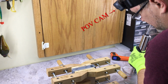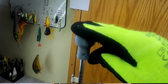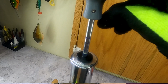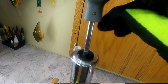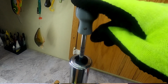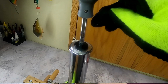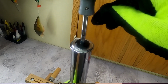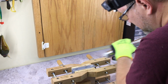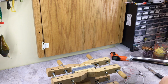So I'm going to suck up the plastic. Start injection. Just 2 fingers of pressure, nice and slow. Watching that line. And as soon as it stops, just hold pressure for a bit. This mold has some small gates in it, so I do have to inject slowly, but slowly usually works best anyway. Alright, just going to pop that out, top off my sprue, and clean out my injector. And wait another 5 or 10 minutes.